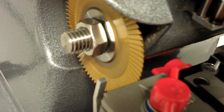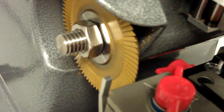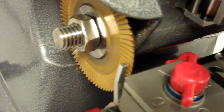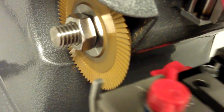And this is what it should do. It should touch the front of the A. Now remember, when you calibrate the cutter wheel, you want A side facing the cutter wheel with the jaw closed all the way. You should hit the front of the jaw and then touch that shoulder stop.